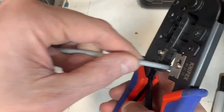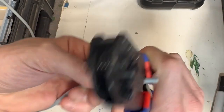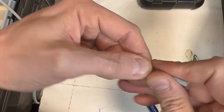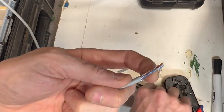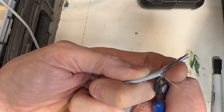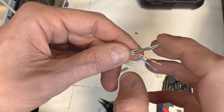There's no need for pass-through connectors. I'm doing this for a camera so first of all you put that in there, push up against the blade and score round it. That'll then bend off. The next thing you want to do is remove the string — pull the string out and use your sharp pliers to get under it and cut it off. Now all you're left with is the conductors. Split them open.